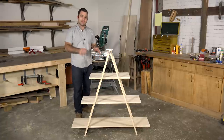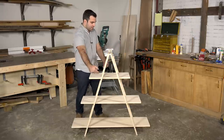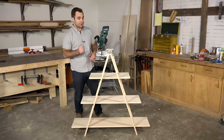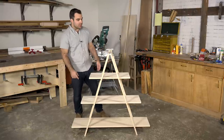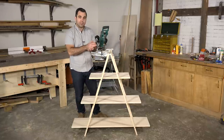It's select pine, so it's nice and free of knots and other defects. We got one-by-twos for the two frame pieces and one-by-twelves for the shelves, then some oak dowels — that's pretty much all you need, plus the hinges. We're going to get started by building these two uprights and frames, those are going to be doweled together.